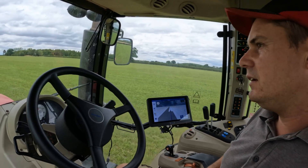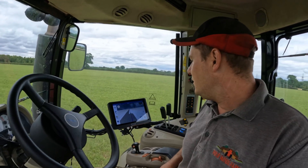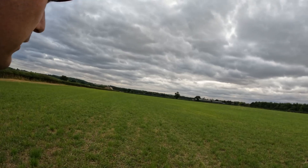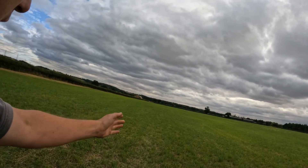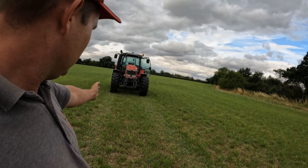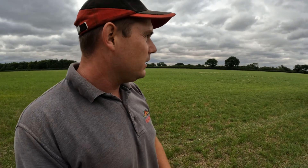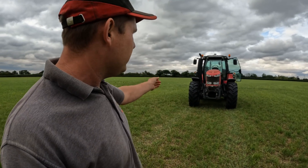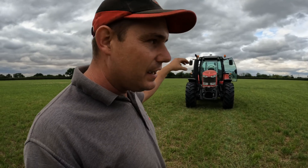We're back within a centimeter of accuracy - that's pretty impressive. The tire marks are running down there and they are literally bang on the money with the tractor. If there are any offsets needed - if you notice you're running slightly wider one way - your dome might not be exactly in the middle of your tractor, so you can put an offset in the computer and cancel that out. It's nice and easy, and it's actually very, very good.